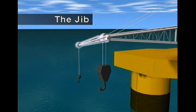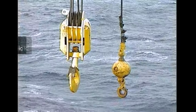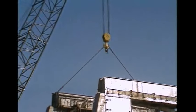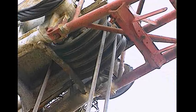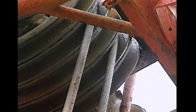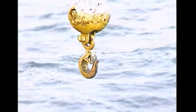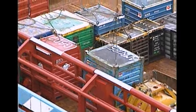There are two hooks that can be used for lifting: the main lifting hook and the whip line hook. The main lifting hook is used for lifting heavier loads; the line to the main hook is spooled through several rows of sheaves to increase its lifting capability. Because of the number of runs around the sheaves, it takes longer to raise and lower the load. For lighter loads, depending on the crane's capacity, there's the whip line — since it isn't spooled through an array of sheaves, it's quicker in lifting and lowering light loads.